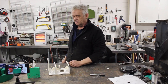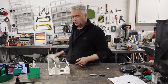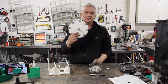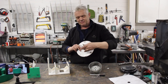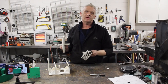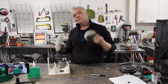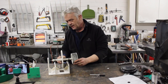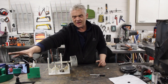There's the cradle pretty much finished, and you'll notice I've glued in a coil — it's a coreless coil, the center of a microwave turntable motor. Here's the rotor: it breaks down into three bits. We've got the disc on this bit of pipe with eight magnets on it, the pen stuck in a bit of board with magnets so it sticks, and then this bit that goes on the end. I put this bit on the end because I'm going to blow on it to make it work, but having it like that means you could fit a whole host of things on there.